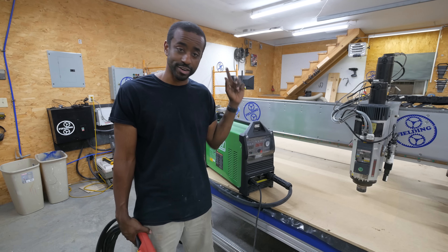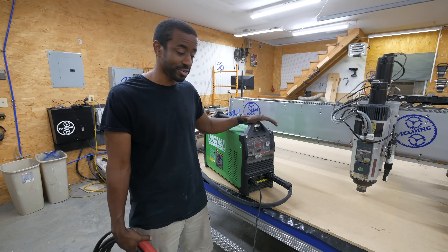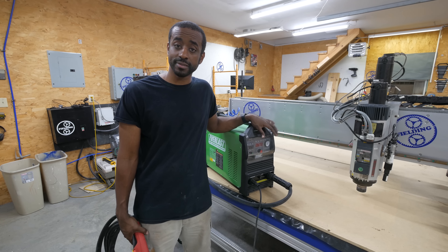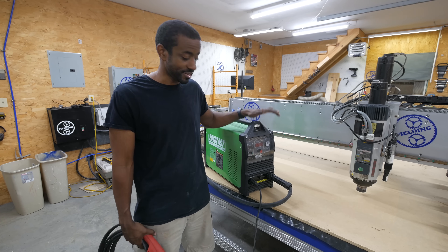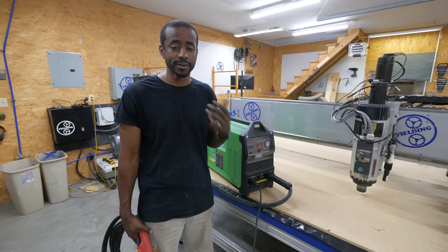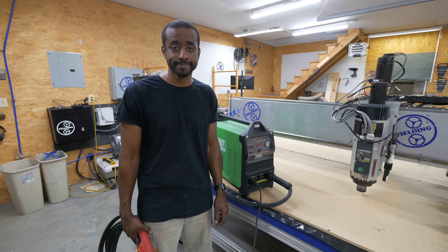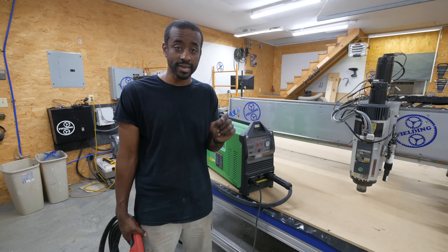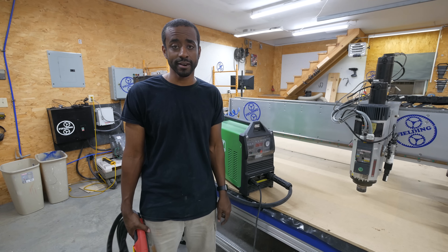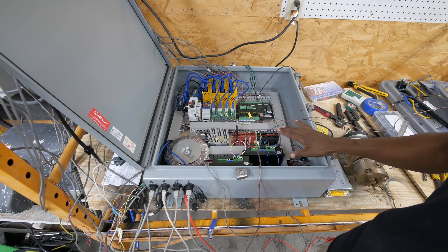This is another example of a part I overrated to make sure I could run a full program and it would still be good. There's a duty cycle on this just like everything else, and that duty cycle improves with the amount of amperage the machine can handle. This can handle up to 80 amps and most of the time I'll be running it between 30 and 50, so I should be good running at only about half of its rated capacity. You'll also need a fairly good-size air compressor for this, as well as for the automatic tool changer.